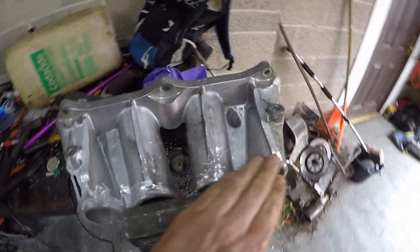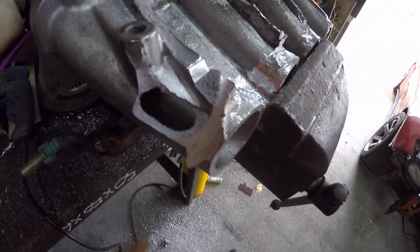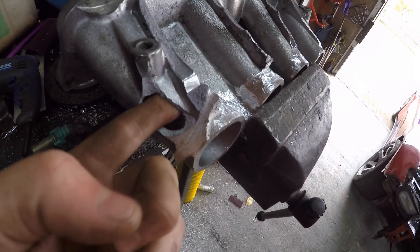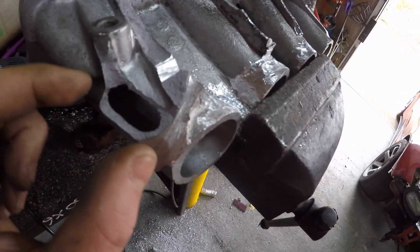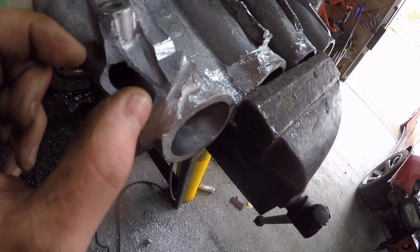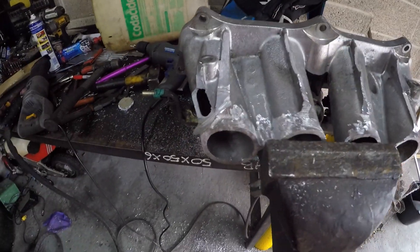So I've managed to buff it all down. However, look at this big dirty hole here — that's going to be repaired. I'll be able to repair that with the TIG; it's not a problem. It'll give me a good chance to practice welding this sort of cast. I'll clean up the edges, take all the sharp pieces off it, probably just make a wee bit of plate — three mil thick stuff — and bosh it on there and weld it up. That bit repaired. But that is a pain in the arse!